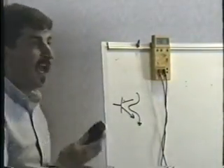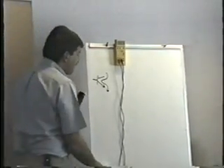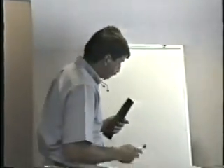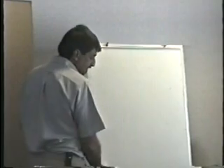Not only does this test tell you if the transistor is good or bad, but the test will also tell you if the transistor is an NPN or PNP. If you happen to have an unknown transistor and you want to know what's going on with it, it'll tell you if it's NPN or PNP — the two opposite polarities.